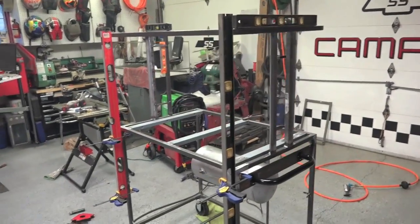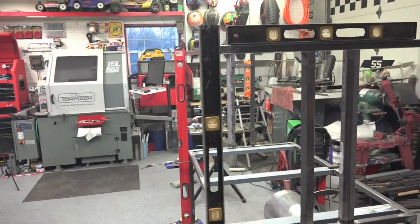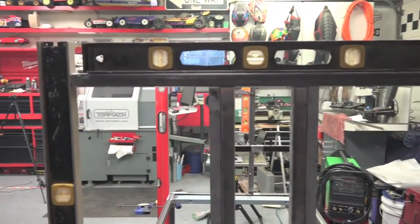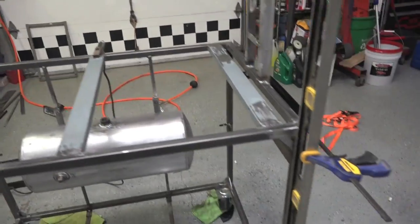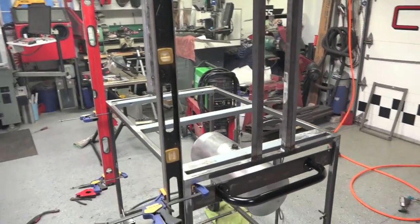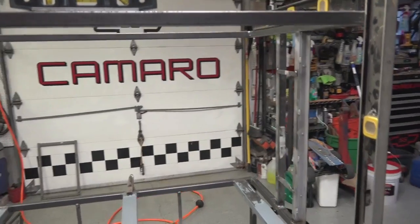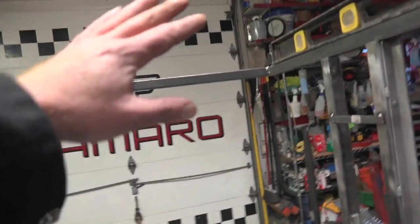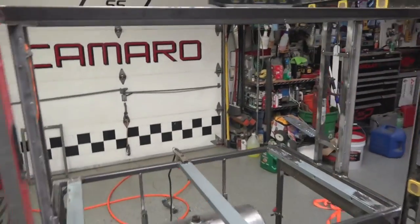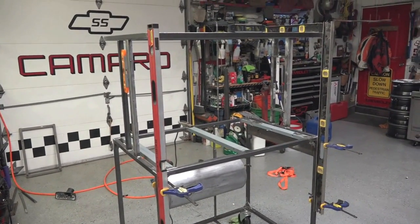The top's just sitting there in place. I've got levels on there clamped to the bottom just to square everything up - level there, level across there. Now that we've got it all true and squared up, let's get this top plate welded in. This will have a cover that goes over it, and inside here will be the two heating elements. She's coming together slowly.